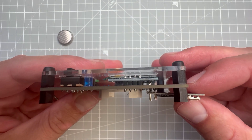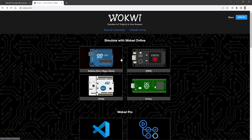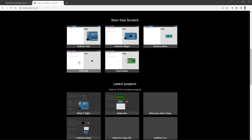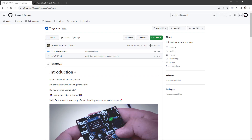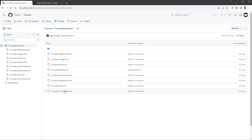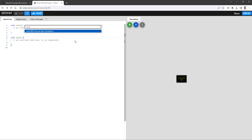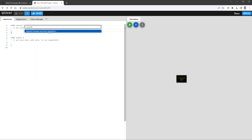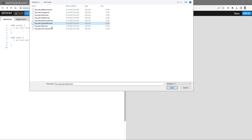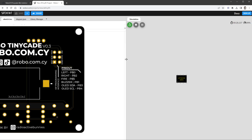While waiting for a new programmer to arrive, I decided to try the games inside a browser. In my last video I showed you can simulate an ATtiny85 project using the Wokwi online emulator. But I haven't mentioned that you can actually run hex files on this emulator. Opening the GitHub for the TinyCAde project, there is a folder with all the hex files for the individual games. You can load a hex file in Wokwi by pressing F1, typing 'upload firmware and start simulation,' and selecting one of those hex files.